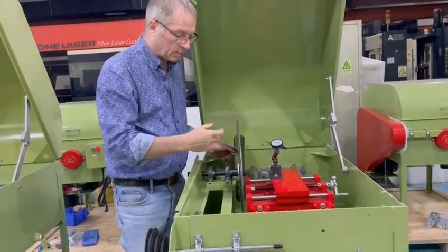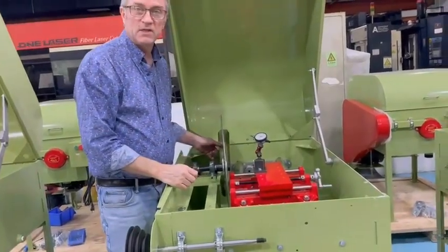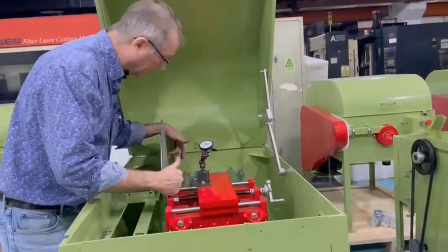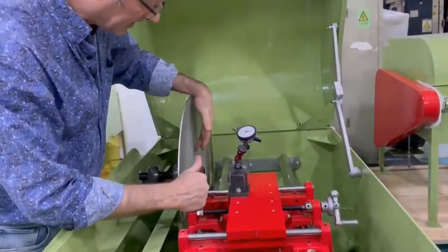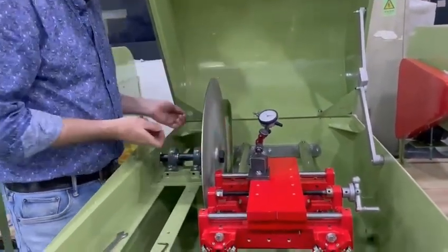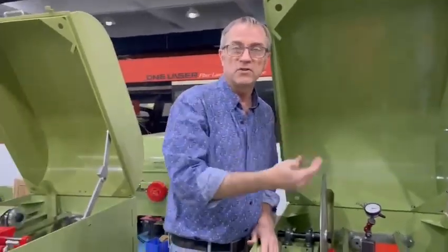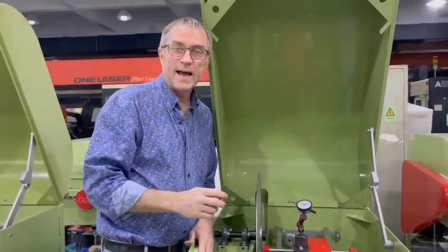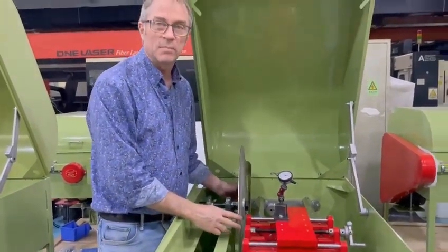The best way to check for dishing — if you have a blade you're having problems with, or a blade you think might be dished — is to get a hard metal ruler, a good ruler, and lay it across the inner part of the blade inside the teeth. If you are touching on the outside with a gap in the middle, or touching in the middle with a gap on the outside, your blade is dished. You check this side, you check that side, and the dish will be the opposite on the other side. If your blade is dished, there used to be shops that would fix that, but there's not really anybody that does that now, partly because the cost of blades has come down a lot.